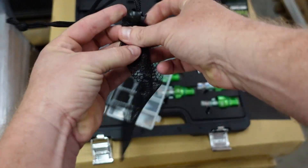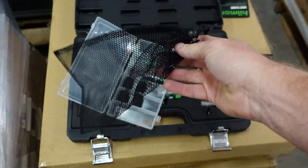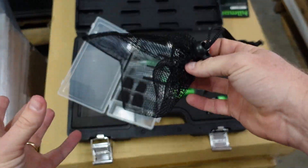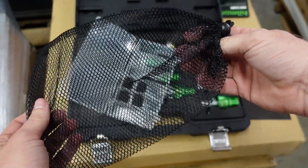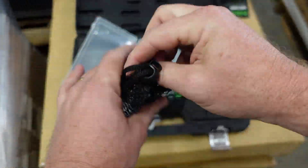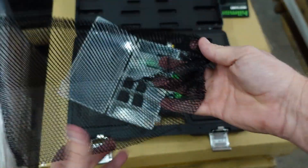We also have a catch net that you put over the end of the tubing — you just zip it down so that it catches the pig when it comes out. I would suggest putting an oil pan or something underneath the tubing on the outside as well to catch any residual. If the tubing is pointing upwards, you can place a rag over the catch net so it catches everything, and then have a pan underneath for any residual liquid.